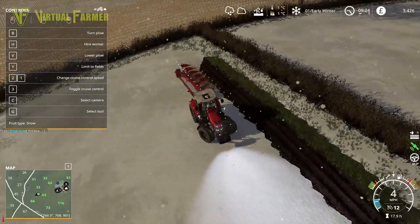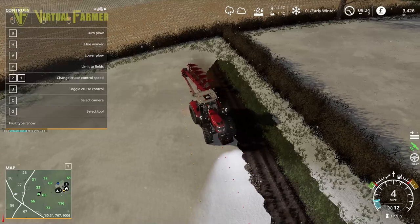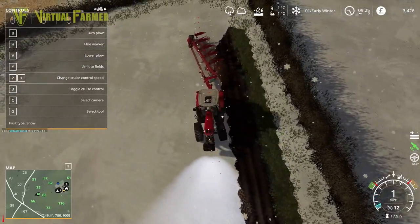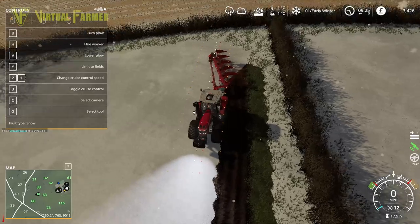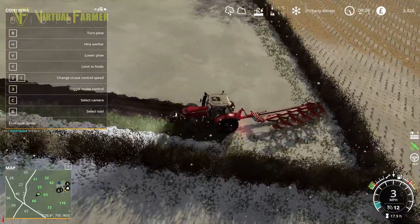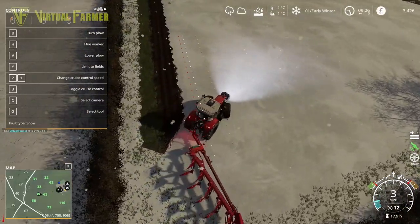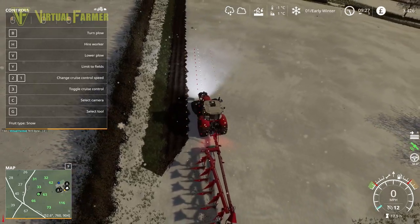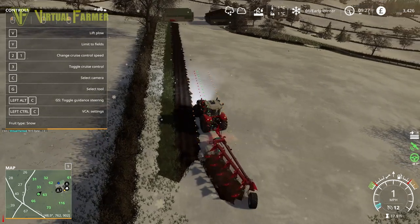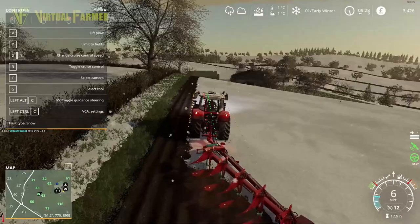We've got a fairly good offset; it looks like the width is set fine. I'll run this a little bit longer just to confirm that when I make my turn and flip the plow, it gives me what I want. Come up to here, back off a little bit, turn the plow, and then around and over. The nice thing about this one is that it runs on a wheel at the side, which means we're able to turn the plow without fully lifting it off the ground — though it's a little bit more difficult to maneuver when reversing.